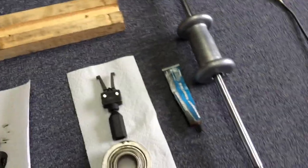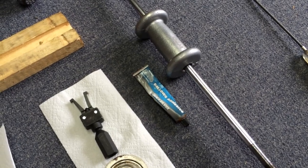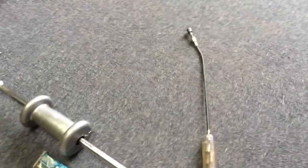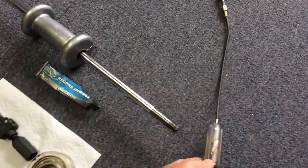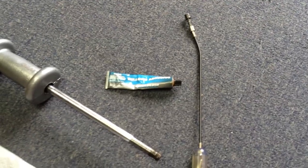Now onto my bellow issue. My bellows pulled away at the bottom — that is the drive bellow. Who knows how long it's been not seated; you can see the clamp is pushed forward. My bellows pulled away from the bottom because the out-drive was stored in the upright position for a very long period of time. I used my carburetor tuning tool to get into the clamp that clamps onto the bellow. I loosened the clamp, got some Mercruiser bellow adhesive, and re-glued the bellow back onto the transom assembly.